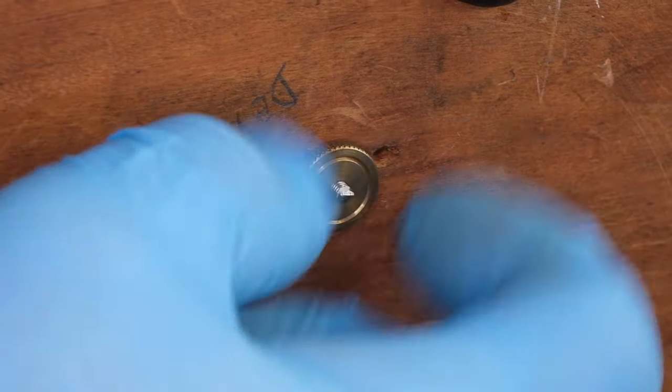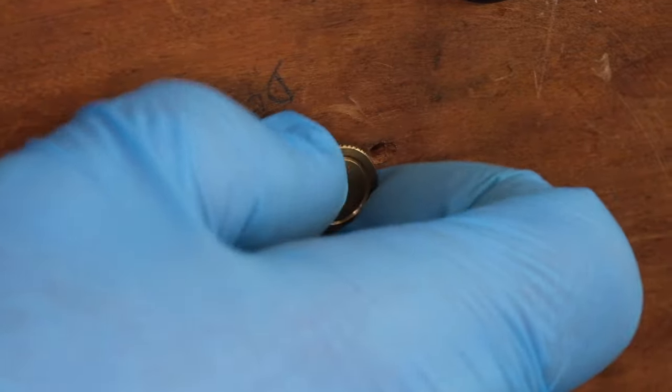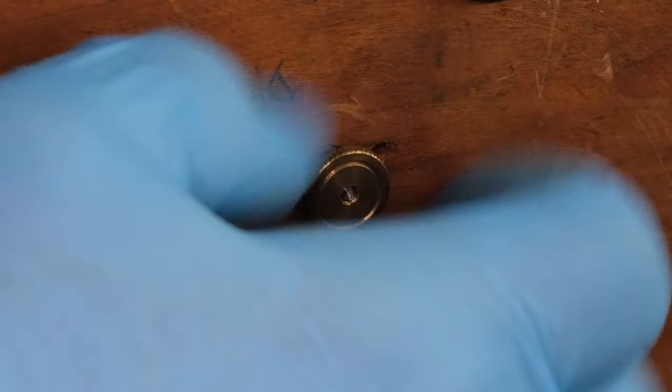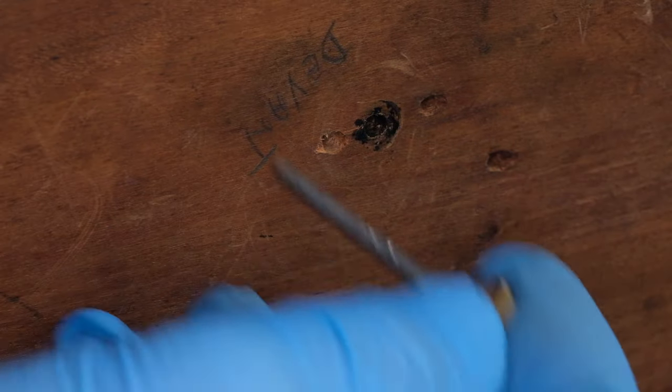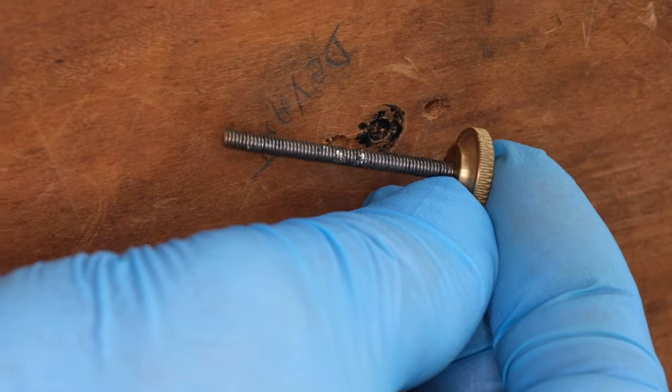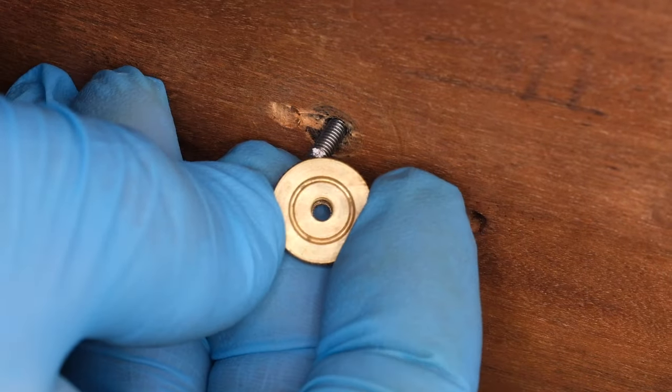So with the power safely off the mainspring, we can remove the movement from its wooden base. I note that the knurled movement retaining nuts are later, and the studs onto which they fit have been damaged and cut by holding with pliers or something, but I suppose they're functional.